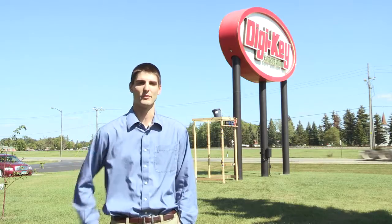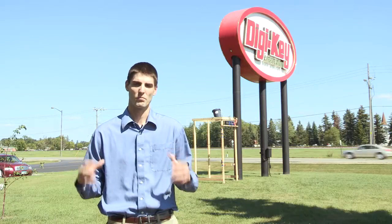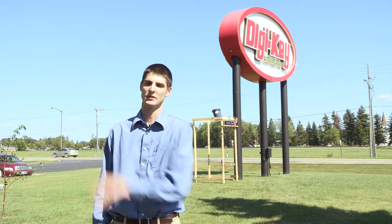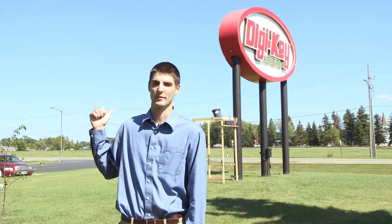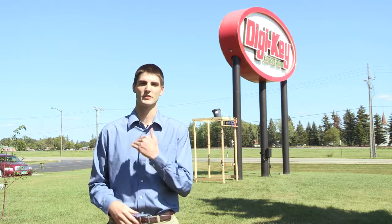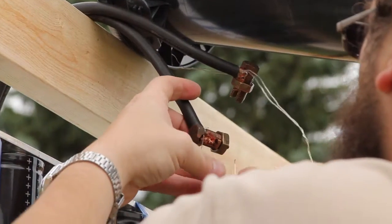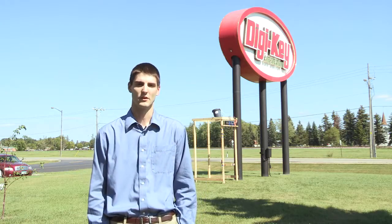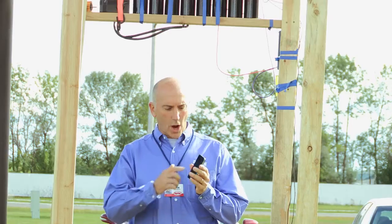At the base of the zip line, we have a couple of photo diodes — photo sensors with a light beam — and once that rubber chicken breaks that light beam, it will close a load switch. We have a 0.8 farad capacitor bank pre-charged to about 45 volts, and once that load switch closes, it's going to apply all 45 volts across this tiny fuse wire holding the bucket in place. And once that fuse goes, the bucket will tip and pour all that cold ice water right on Dave's head. Here we go!